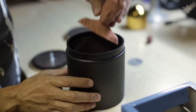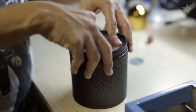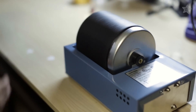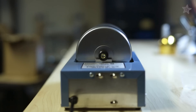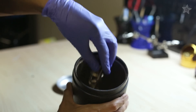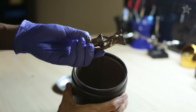Obviously don't use bigger screws for smaller prints. After you have your screw sizes ready, carefully place the print inside of the barrel and begin tumbling — just make sure not to over-tighten the lid. Remember that smaller prints can take about 6 hours to look really shiny, while larger objects with a lot of detail can take up to 36 hours of tumbling to get a very polished look. Avoid getting dust on your hands by being sure to use gloves to remove your prints after tumbling, as the screws grind together and create metal particles.